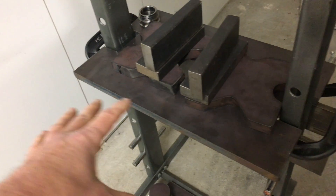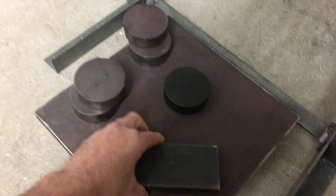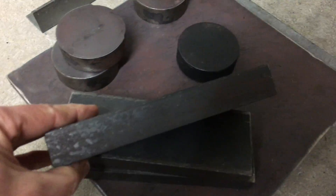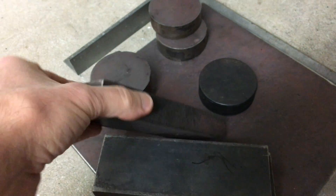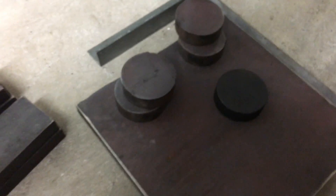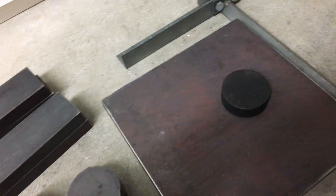The problem was how they set up things down here. These are pressed plates that I've purchased off eBay. If you go in there and search 'shop press,' you can find them — it's just mild steel, A36 steel, which is not the best steel in the world. But when you've got an inch of it thick, it doesn't want to bend too much under 12 tons of pressure. I wouldn't recommend using some of this stuff for 200 tons, but if you're just dealing with 12 or 20 tons, you're probably okay.